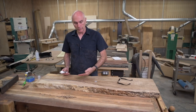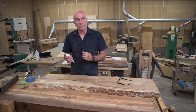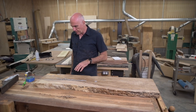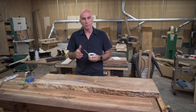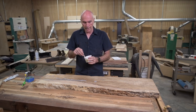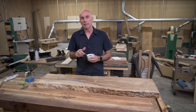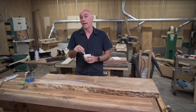I put some tape on the backside where I think these cracks might go all the way through, and now I'm just going to put a little silicone around the crack on this side to act as a dam to hold the epoxy. I'll let this dry for a little bit and then I'll put some epoxy in it. I used the TotalBoat epoxy — it's the bar top stuff, so it can only go in layers of about an eighth of an inch or so, which is fine for filling cracks. The advantage is that it dries fairly quickly, so it'll be fine tomorrow. I also used some black mica powder rather than a dye because the powder doesn't stain the wood as badly as the dye does.